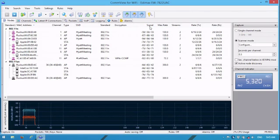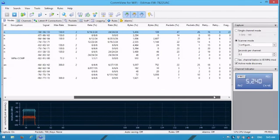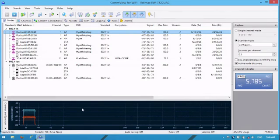Once you know, you know. For example, this first access point shows a minimum signal of -59, average of -56, and maximum of -55, plus data rate, number of streams, and more. Scrolling over you can see there's a lot more information - it's a mega scanner. At the bottom we're getting a display that looks like spectrum analysis, though it's not the real thing.